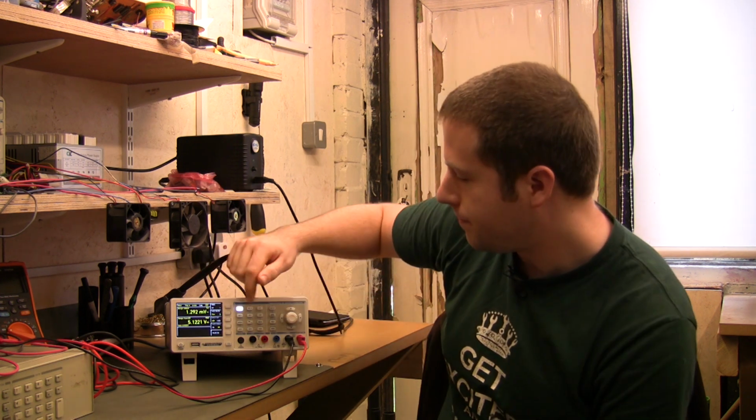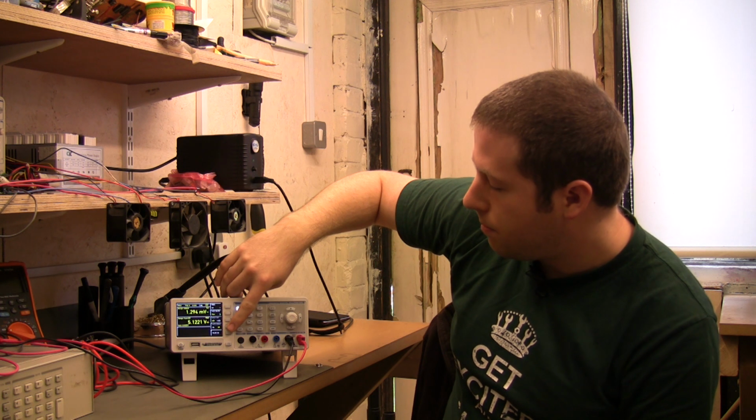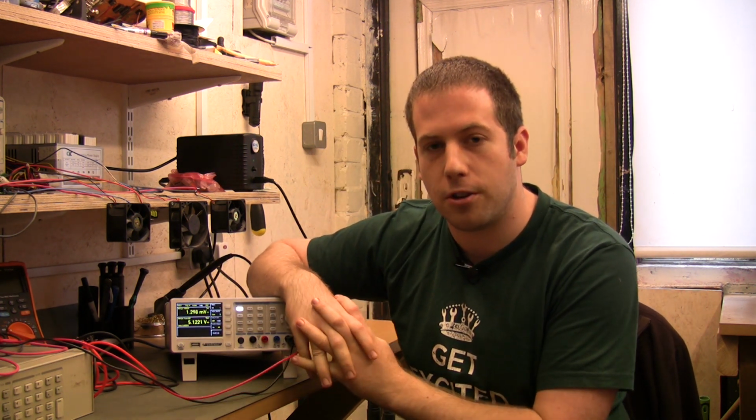Now, particularly some of the Agilent handheld multimeters didn't stay at a fixed 10 meg input impedance, and therefore you just found you were getting completely incorrect results with high voltage probes. The auto zero, we're leaving it off here at the moment, but it's a nice little feature where it'll try and zero out any voltage loss in your cables and probes automatically.